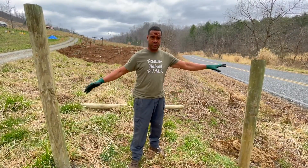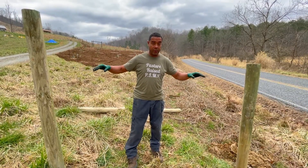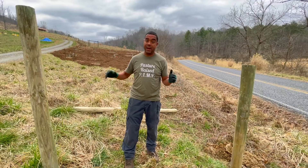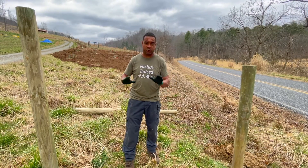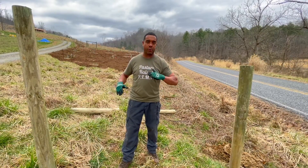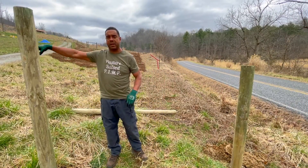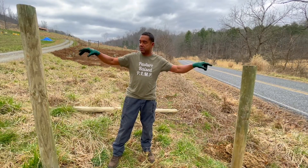We've got these eight-foot posts set in the corners and now we're going to put some horizontal braces in here. There is some debate as to whether you should situate it with the terrain or whether it should be level — it's a personal preference. Being a journeyman electrician by trade, there is almost nothing I put in that isn't plumb or level. In this particular case I want it to be level even though the sections will be at different elevations, because I think it looks better. So we're going to clamp these on, get some marks, notch them out, and get them where they go.